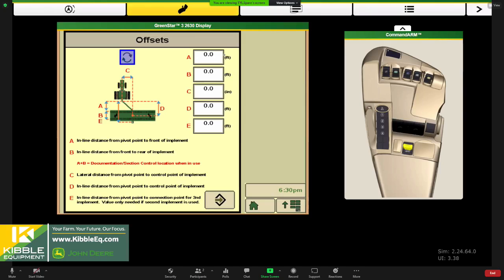That's when it truly is a double rank and I have an equal number of row units in either scenario. In that narrow transport situation, where it really is just a few rows that are off, there are more rows on the wings than in the middle, so I usually use that number, or I measure to those. I hope that clarifies it.